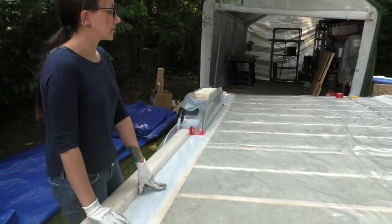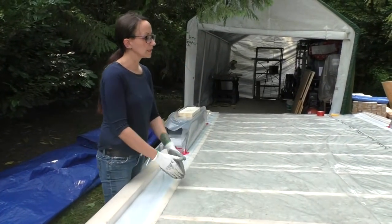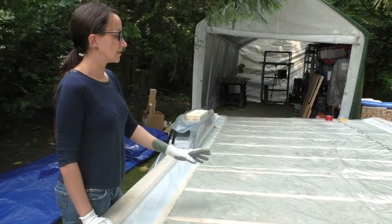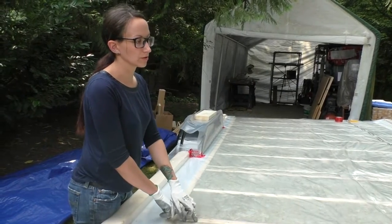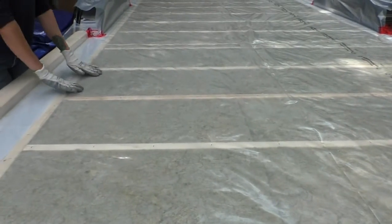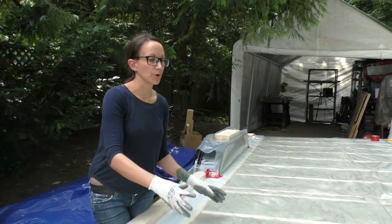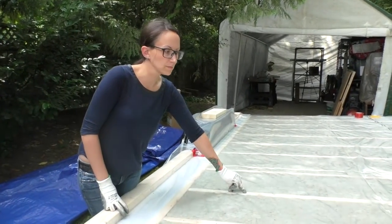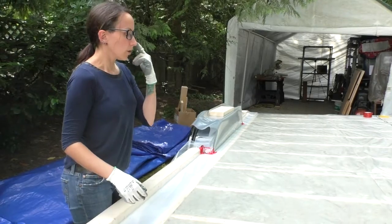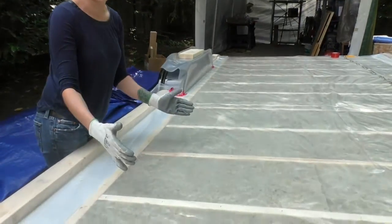We also noticed something after test fitting, that our parts where they join were not on a beam initially. That was because when we decided to insulate the subfloor, we planned for the insulation and didn't realize that our original design had the beams in a certain location because of the length of the boards, so that they would land on beams, thinking that it was going to be easy to just install the insulation 16 inch on center and everything would be fine. The problem with that is your sheathing actually doesn't line up on the joists like it should at the seams, because it's actually 47 inches if you factor in the tongue and groove section that overlap. So instead, what you probably should do if you're framing this way is make it so that you are in line with your sheathing, not the insulation.